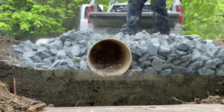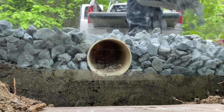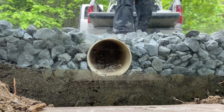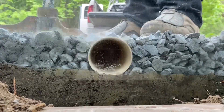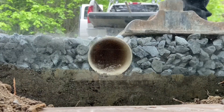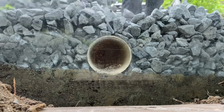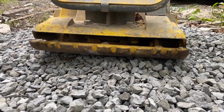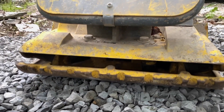Let's take a look at the side profile of an open graded base installation with a three-inch perforated pipe as an overflow. This pipe system is not always necessary, but for areas that are going to see a large volume of water, it's a good idea to be able to capture some of that water and carry it away — especially in really heavy rainfall events.